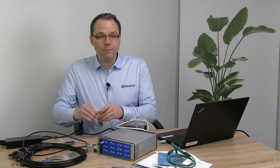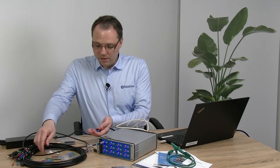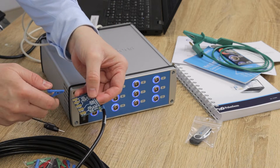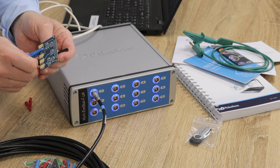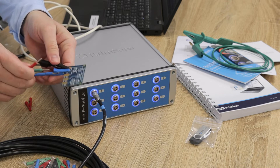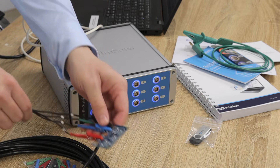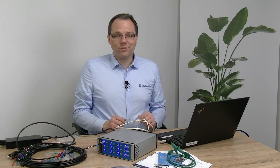We have connected our cable, powered the potentiostat, and now we need to connect our cell — in this case, the dummy cell. I connect the blue clip to the reference electrode, to the pad labeled RE. I connect the black clip to the counter electrode, to the pad labeled CE. The red clip for the working electrode goes to the pad labeled working electrode B, which is a 10 kilohm resistor — making it very easy to predict what kind of results you get.